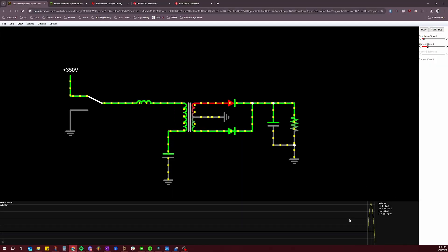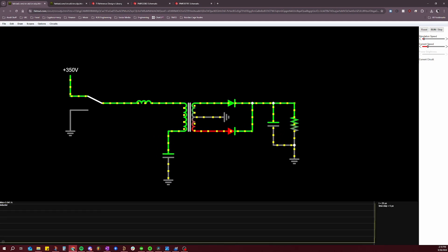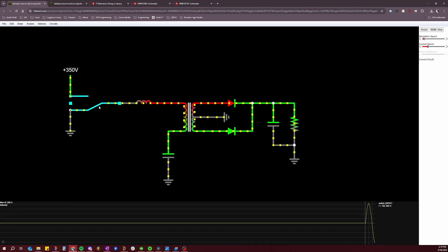Now let's go over some frequently asked questions. First: what is zero-volt switching and how does it work? Zero-volt switching is when the MOSFETs switch on with zero volts across them, avoiding switching losses. The key is the alternating current in the resonant circuit — since it has a positive and negative half cycle, at some point the current is zero. By Ohm's law, zero current means zero voltage. So as soon as the current hits zero, we switch on the other MOSFET, which turns on with zero current flowing and therefore zero volts across it.